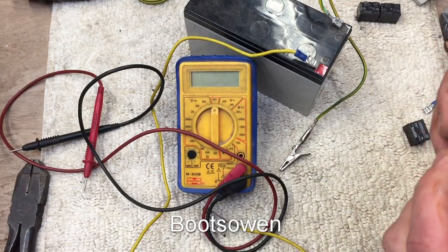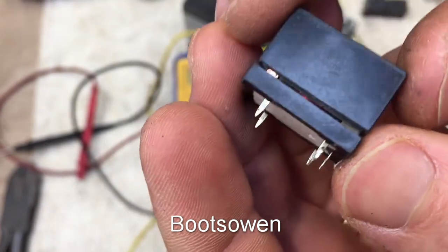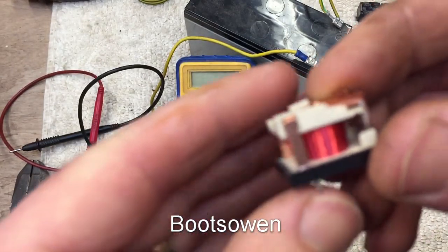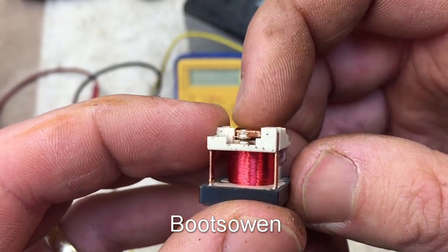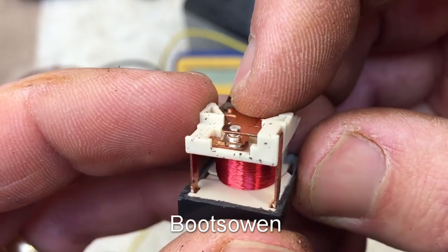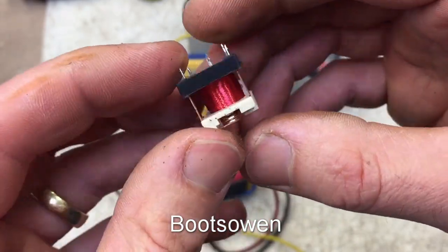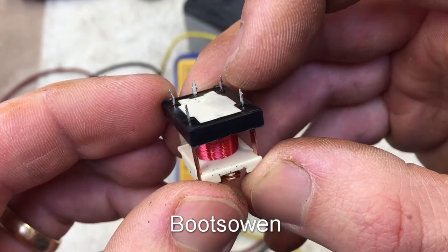I managed not to pay attention to which one was which, but I cut all the way around with a hacksaw very gently. I went in far enough to touch the copper, but not a big deal. Let's get this cover off. We've got a big coil which pulls down and pulls that contact across. So this one here is normally attached to this, which is attached to the center tap. And then when the solenoid pulls, it goes like that — that's the clunking you hear, joining the back center contact to the front right contact.